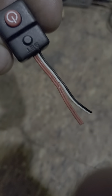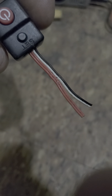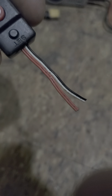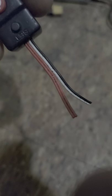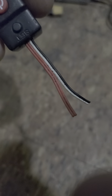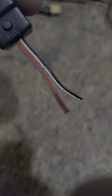I have maybe four to five ESCs that I've eliminated this power switch on, and I've had better performance out of my ESC Max 5, Max 6, and the WRA. Pretty much any Hobbywing ESC that has these four wires — twist black and white together, red and red together on your ESC, not on the power switch, and you'll be running direct.